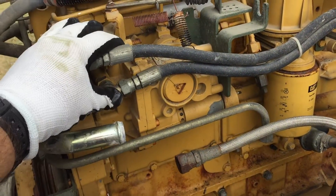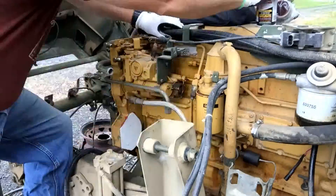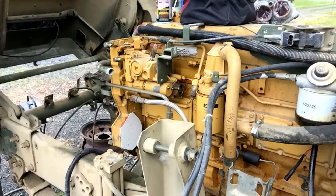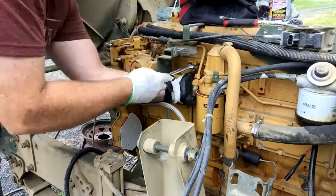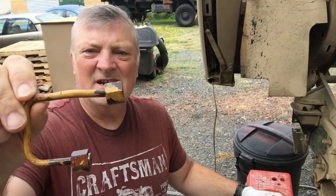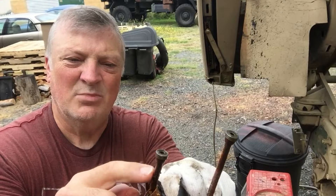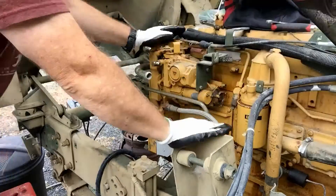Next will be the fuel control. Oh, this is going to be a beast. You really have to be very, very careful with these. These nuts are kind of rusted on to this point here, and if you just start yanking on them it'll actually twist this thing in half. That was what all the fussing was about — trying not to break this tube while trying to break this loose. So lots of patience and lots of PB Blaster. There we go.